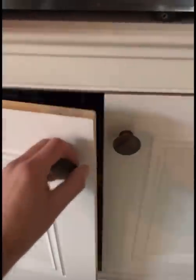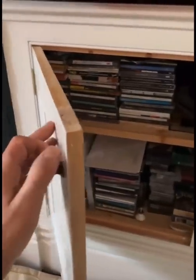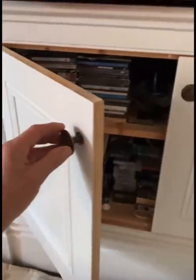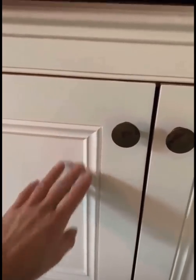For the sake of comparison, this one was made from pine — redwood I guess — PSE 18 mil or thereabouts. It looks like I've done a tenon and a through groove that's the thickness of the panel, which is MDF because it paints better — I'd figured that much out at least. The panel at that stage might have molding applied, very similar to how we do it now.